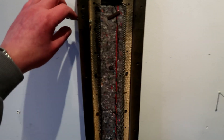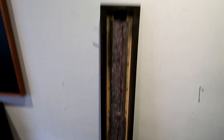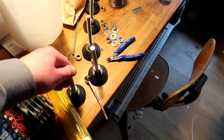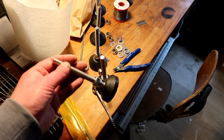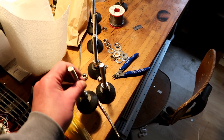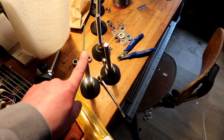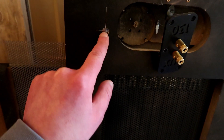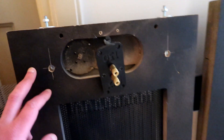Resonance is really ugly at that point so you want to avoid it. These are my big guns — very professional, you can only do this a few times. It's a huge mess. I was going to use my other feet, not the chrome ones, because I've got plenty of space to either heighten the whole contraption or tilt it. These are too long but I'm not going to cut them off right now. I made new feet that hold both drivers, attached metal inserts with sideways nuts because these panels were just screwed with wood screws and they fail over time.